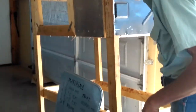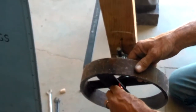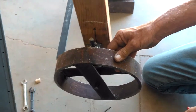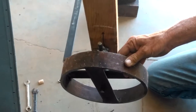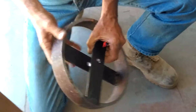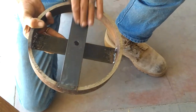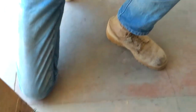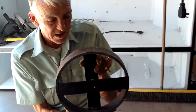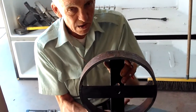We're going to get after the wheels. I'm going to pull this wheel off — it's a 10-inch, well, pipe size. Iron pipe size is always inside diameter, so it's 10-inch pipe. It's 3 A's, and this is where your 8 foot of 2-inch by 3/16-inch flat comes in, and you weld it in there like this. It'll look like a Santa Fe railroad cross, but you've got two bearing surfaces and an iron wheel — a tire that will never go flat.